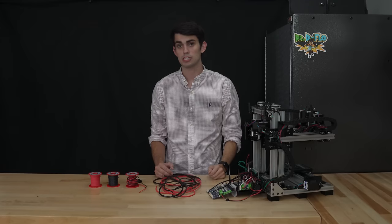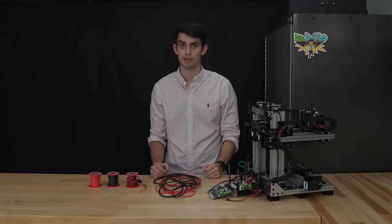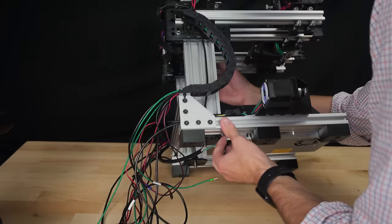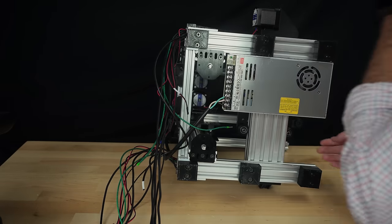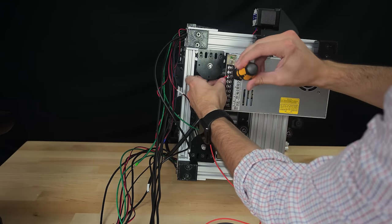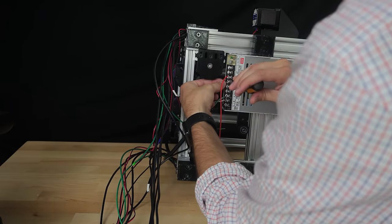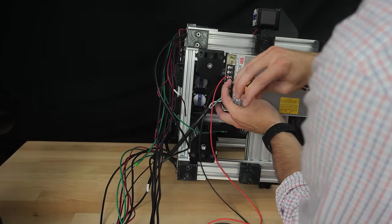Now going to wire the power supply to the motherboard, which divides the power among all the electrical components. In the power supply section, we calculated that Zydex is going to need about 300 watts of power. It is very important that the wires from the power supply are capable of safely carrying this much power to the motherboard. If the diameter of the wires is too small for the amount of power it is carrying, then the wires could burn out.